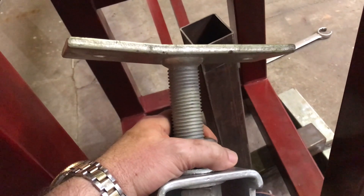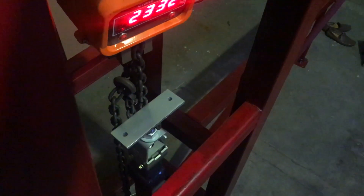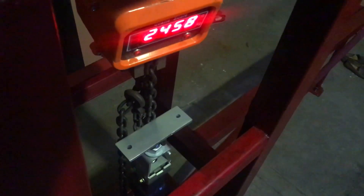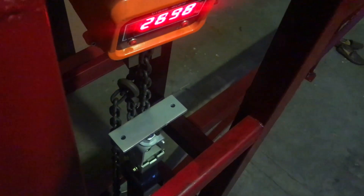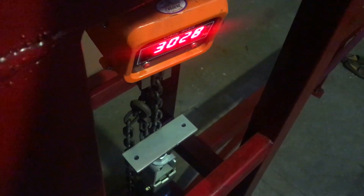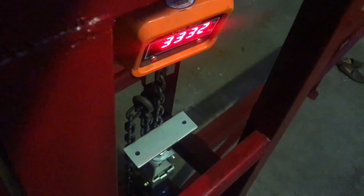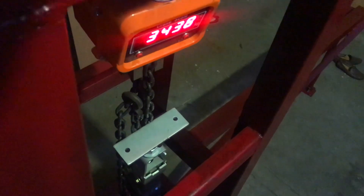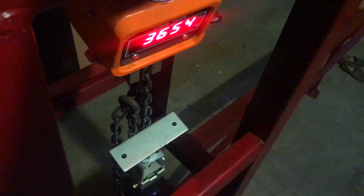So this is actually with our 75 by 75 top, with the eight mil steel plate and the four bolts holding it on, and we're just testing how many kilos it gets up to. The last one was with the six mil plate and it did 4,300 kilos or something like that, so we expect it to do around 4,000 kilos. The 90 by 90 millimeter one was up to 7,000 kilos, so it might go that strong — we've got the chain hooked around one side of that top plate, so it'll bend the top plate, but that's probably immaterial to our test because we're only wanting to check that four bolts are strong enough on the 75 by 75. Three and a half ton — that's pretty good, already a lot better than tech screws.